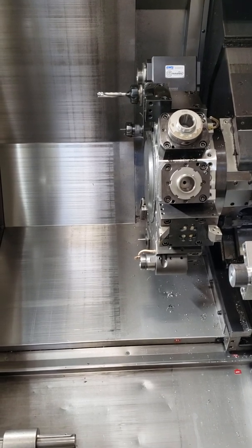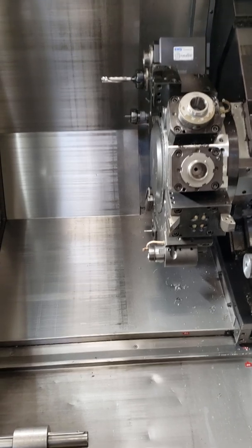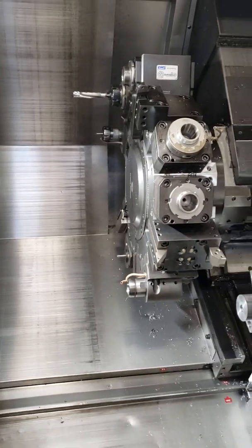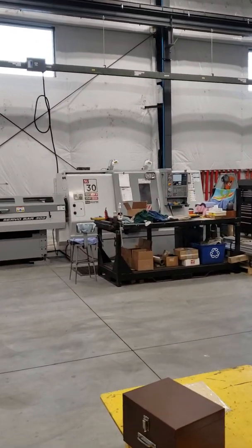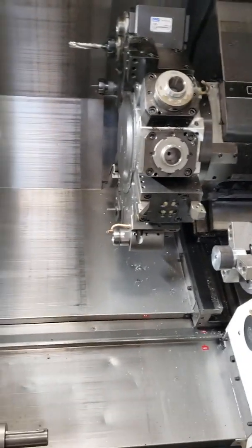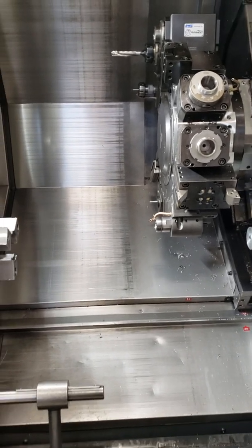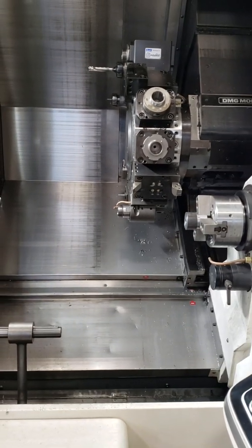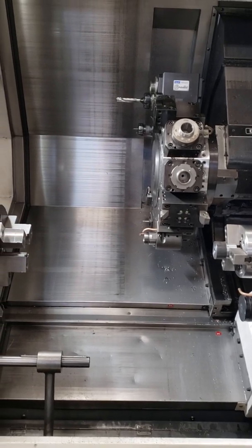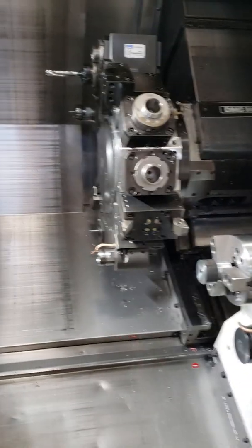Touching off tools. Touch all your tools off the probe first, and then your part. Okay? Running that over there, I would just do the tools. I'd select my G55 off the part, so I would literally cut my part, set G55, and then touch my tools to the probe. Apparently over here, you touch the tools to the probe, and then you touch to your part for G55 or 54.